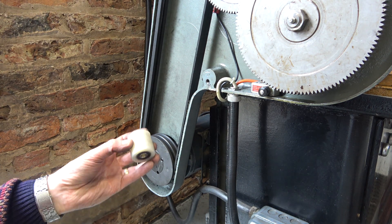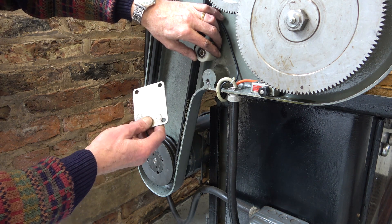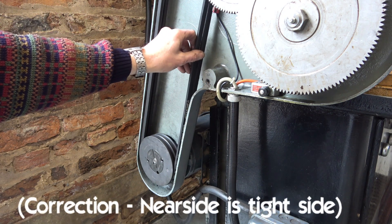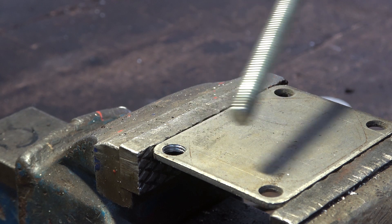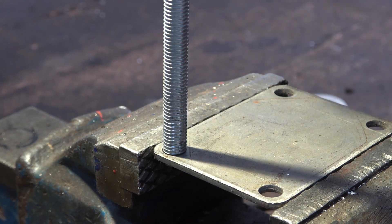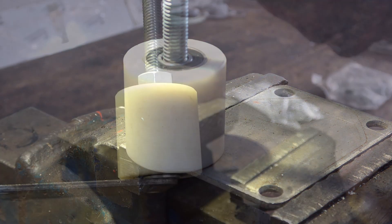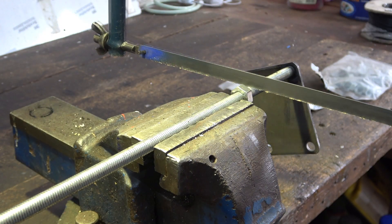Some time ago, I bought this nylon pulley with a couple of sealed bearings in it. What I'm going to do is put that here and use this bracket to put a spring on it — it will just be a very light spring tensioner. When the lathe is running in the forward motion, this side is the tight side and this is the slack side. I only get the slapping for the first sort of 10 minutes till the belts warm up; after that, I don't get any slapping noise. Luckily these holes were just the right size to thread this 10mm, and I've got a piece of threaded bar. I'll slip this on — this will make a little stub axle if I cut it off by about here. I'll just put a blob of weld at the back to hold this in. That'll hold straight while I just put a blob of weld on the back there. I'm going to cut this a bit long — I'll trim it later.